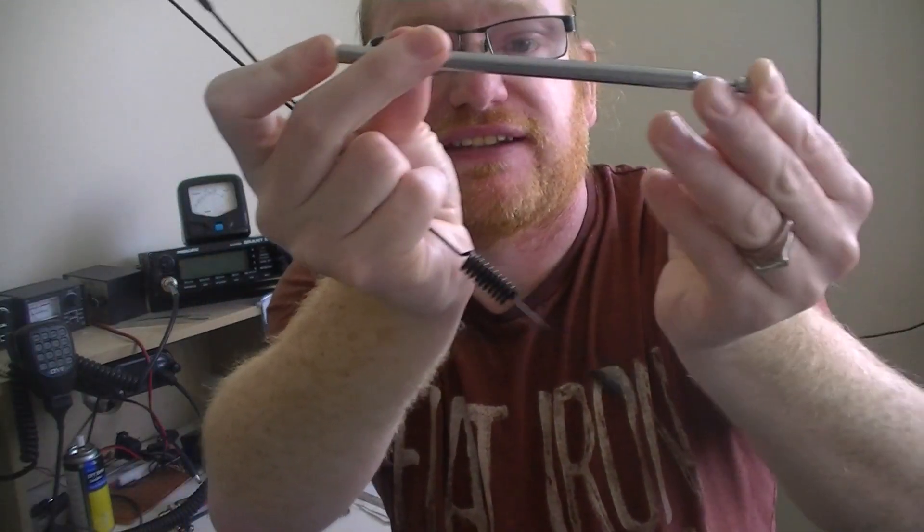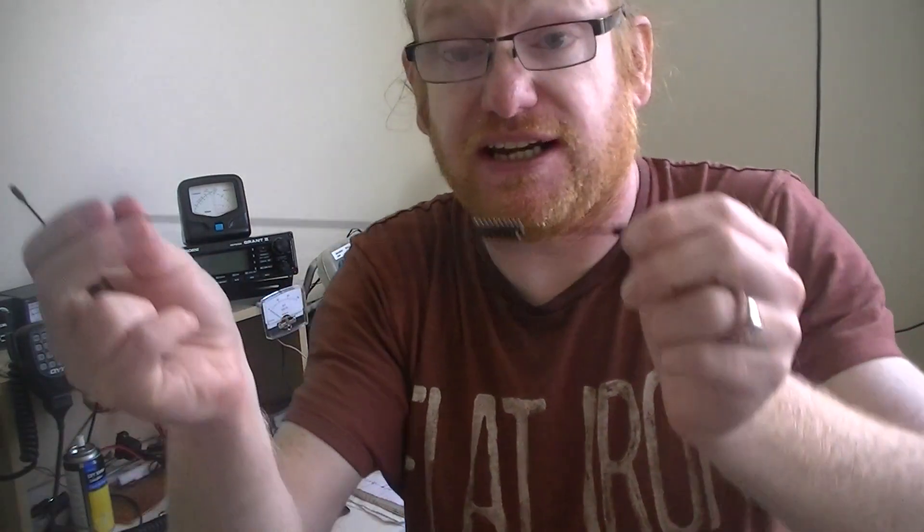So here are the antennas. It comes with a telescopic antenna that screws into the magnetic base, though mine doesn't seem to be threading properly anymore — it kind of starts to spin on the stud. This one, according to the blurb, is a UHF antenna for about 433 megahertz. That would include the amateur radio 70 centimeters band and in Europe also the LPD 433 band — very low power voice transmissions — and also your alarm key fobs and car key fobs, that sort of thing.